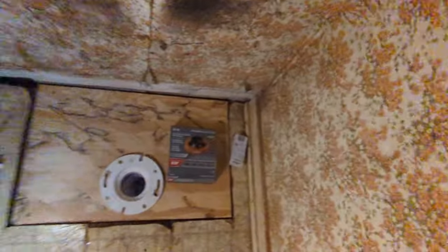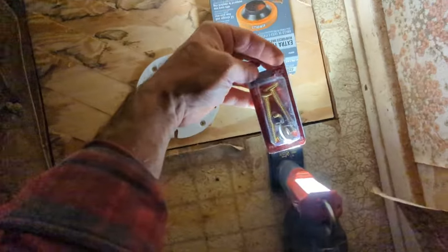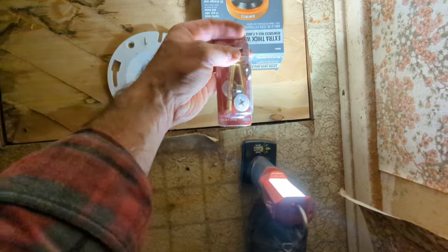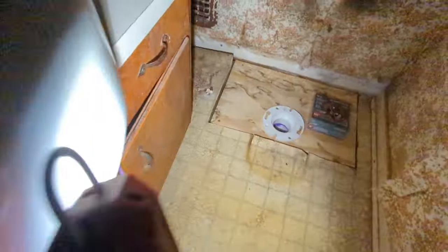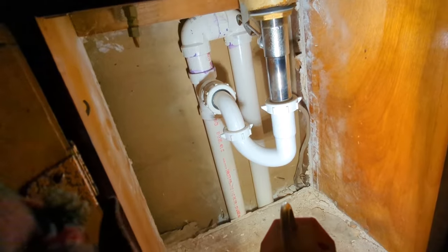Putting up W's. Probably can go back down onto the flange. I got ye old wax ring and a set of the heavier 5/16 coarse instead of the quarter 20 bolts, all brass, and under the sink, plugged this unit, all back together again. Nothing's more than just snug, so we don't want to go crazy before things are aligned and hand tightened, but I just wanted to slam that much down.